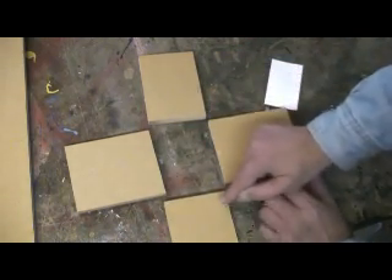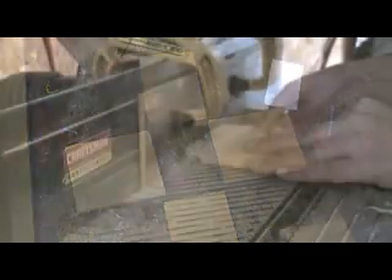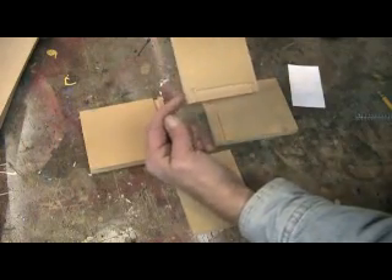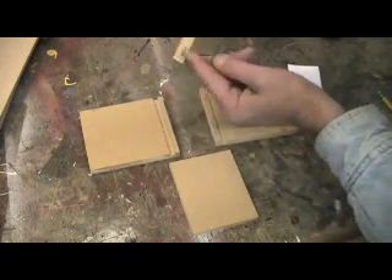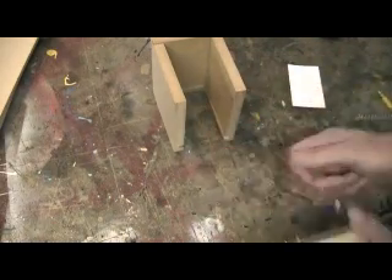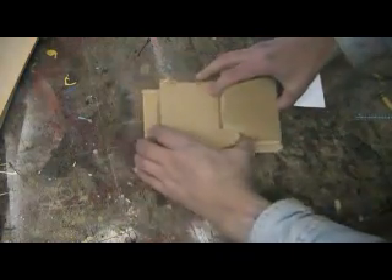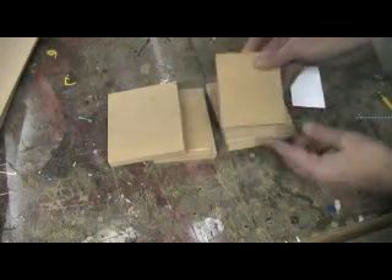What I'm going to do is cut a groove on each of these pieces and use quarter-inch MDF for the bottom. One thing to notice is that I didn't go to the edge of this one — I just dropped it down the router and cut the groove out there, because I didn't want that groove to show on the outside. This is going to fit together like that. This third piece — remember this is the bottom that's going to slide out — I've cut it right to one of those grooves. So this front piece is a little bit shorter than the back piece.